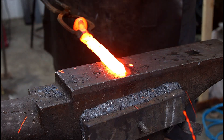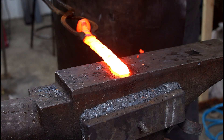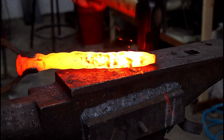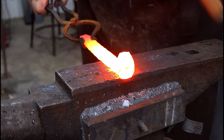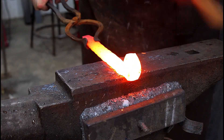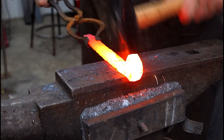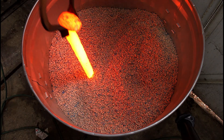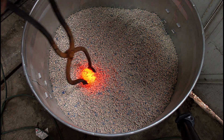Railroad spikes come in two grades: your standard spike, and your spike stamped with HC, which stands for high carbon — usually around 0.3 to 0.4 percent carbon. These spikes were designed for holding rails in place. They're easy to forge and widely available.